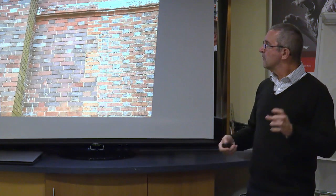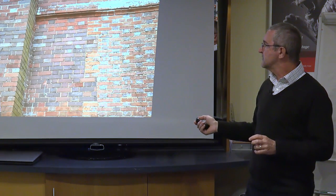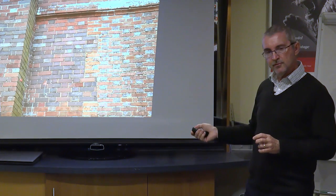And you can see that the wall was saturated through the heavy rainfall, but already after a relatively short period of time, this has held on to the moisture, and this side hasn't. This has already started to release it as the wind and the sunshine has come out. And you see this over and over and over again. Any situation where you get cement on historic bricks where they want to release, because historic bricks are largely porous, unlike modern manufactured bricks, which are much stronger, and clearly engineering bricks are completely waterproof. We see this over and over again.